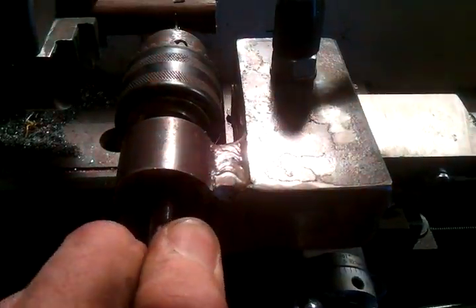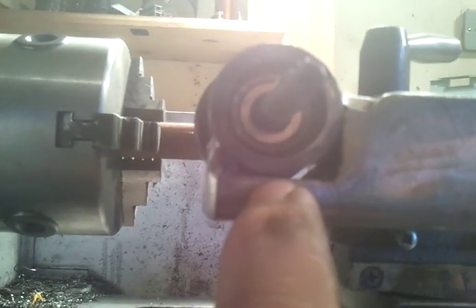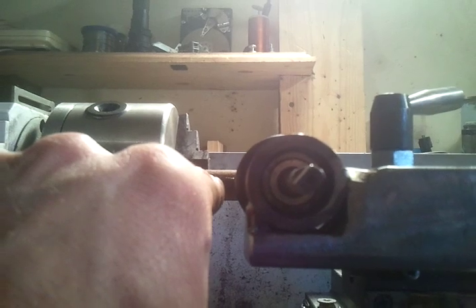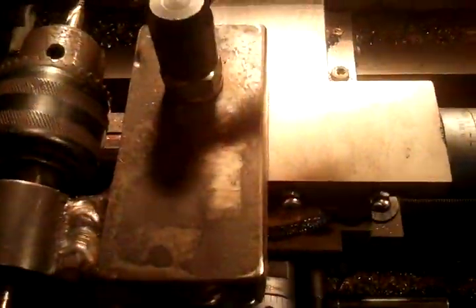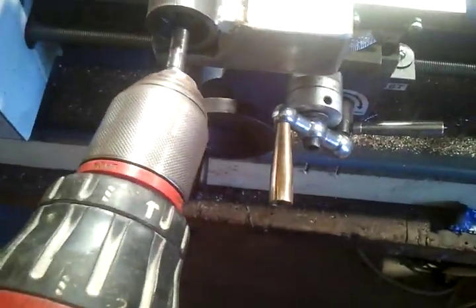I had to space that up a little bit. There's a tiny gap underneath — only about a millimetre — and that was just to get the centre of this chuck directly in line with the centre of the workpiece inside the main chuck. When it sits down, everything is nice and square. All I want to do is drop it on, give it a bit of a tighten so it doesn't move about, and it's spot on. The only way I have of driving this at the minute is my screw gun — I can connect that straight onto the end of the shaft.